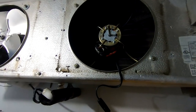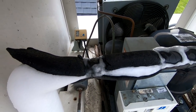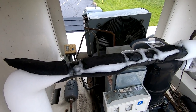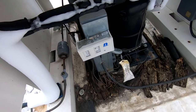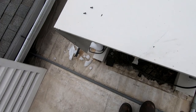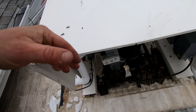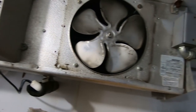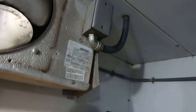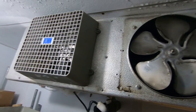It's a pretty tight fit but it fits. This doesn't have a headmaster, so it has a fan cycle control - that would cause us some bubbles in our sight glass. The fan should have been shut off for the temperatures we're in, so we've probably got a problem with the fan cycle control too. That fan's not shutting down - not even a bit. Got to go down there and make sure the rotation's correct.